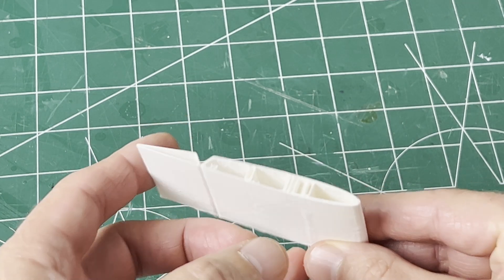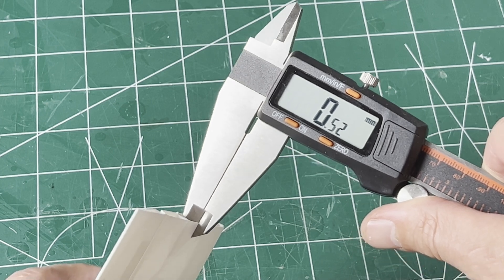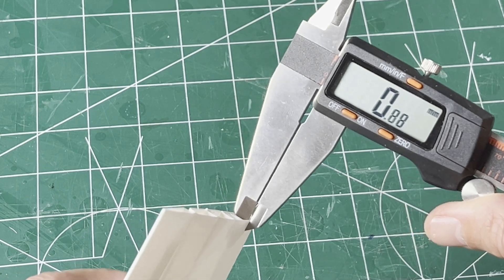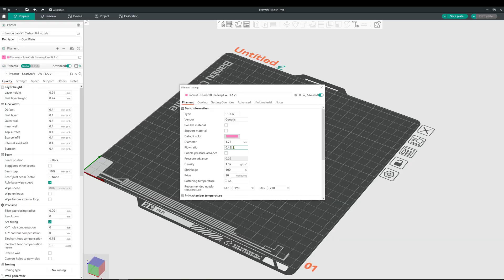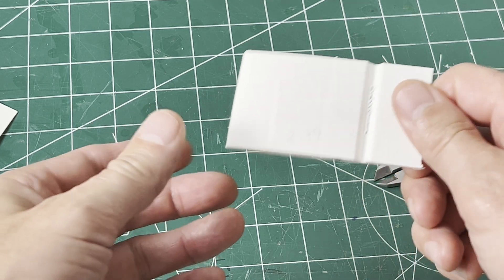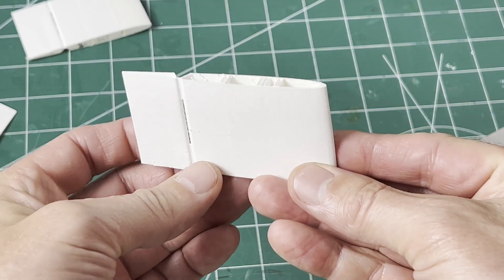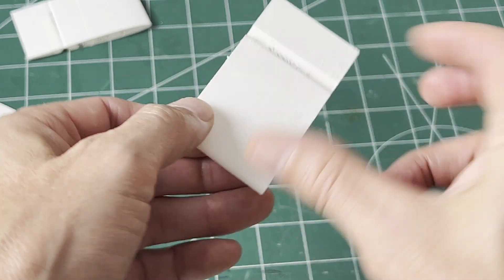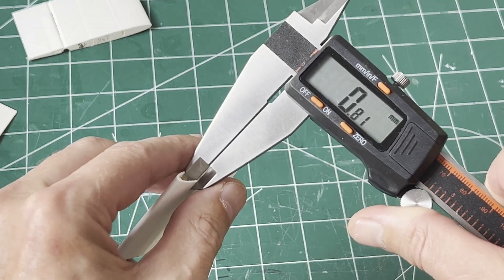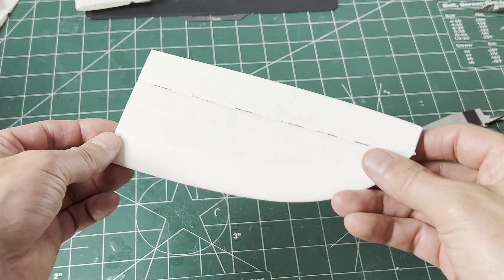The hinge activated without much trouble, but the outer surface was not to my liking. The single wall should measure 0.42-ish, and the double wall should measure 0.8 millimeters — so the material is over-expanded. You can go back to the slicer and lower the flow ratio or lower the nozzle temperature, but only one at a time. Reducing the flow ratio 5% did not have much effect, but dropping the nozzle temperature 10 degrees to 225 worked great — nice outer surfaces, proper wall thicknesses, and the carbon easily slides into the channel.